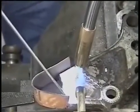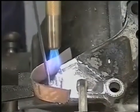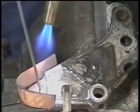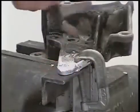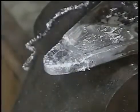There's no need to throw away a part because of this problem ever again. A new ear can be built in just minutes that is much stronger than the original. Steel is used to form a mold in the shape of the ear to be rebuilt. After the part is tinned, just fill up the mold and let cool. A new hole is drilled and it is now ready for use. As you can see, the aluminum will break, but not the repair itself.